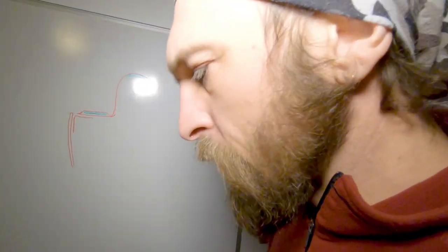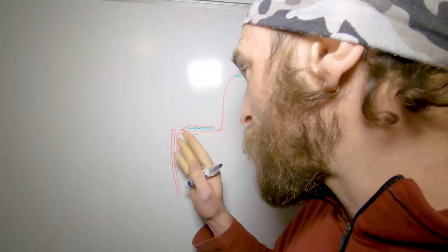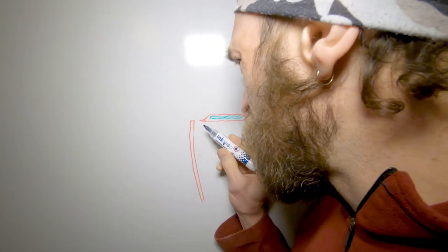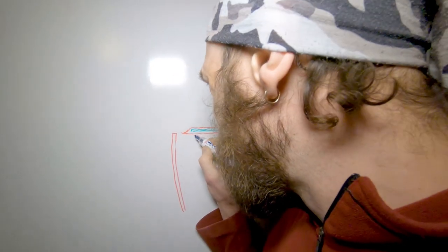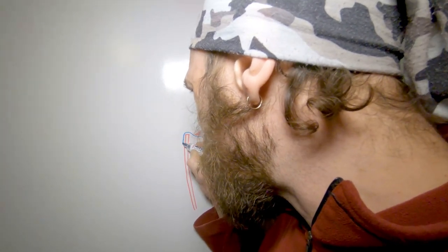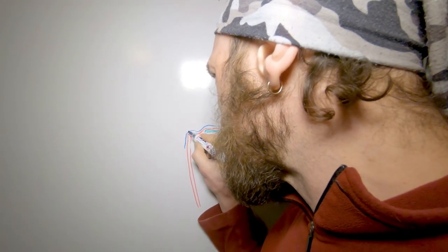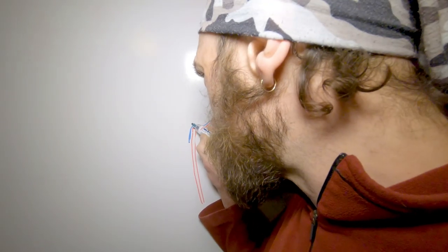So what we need to do, I think, is, I get another colour, here we are, blue. So the repair work, what we're going to actually have to do is take the tape off and reinstate the way that the side deck joins across the top of the hull. So lay some new glass in here, and then lay some new glass across the top. Then use some foam, which I've got some of, and it is green. So it is appropriate that I draw it on in green, then,